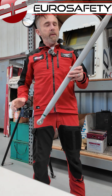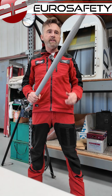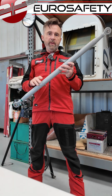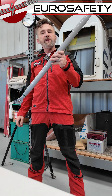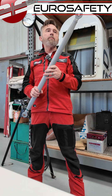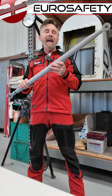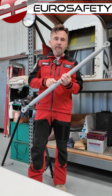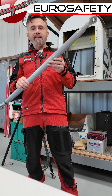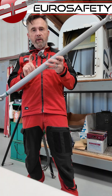One of the more interesting items to find on a disassembled helicopter is one of these suspension bars. There are four of these attached to the transmission, and the entire helicopter is lifted by these four bars. 6,173 pounds are hanging off these bars. You would think they would be very heavy, but they are surprisingly light. No damage is allowed to these bars because they are not a solid piece of metal but rather a hollow tube.